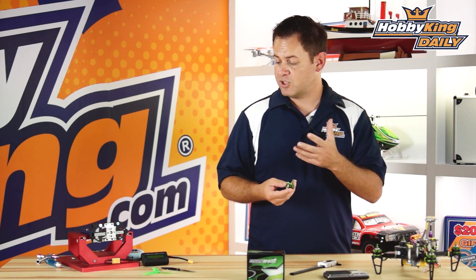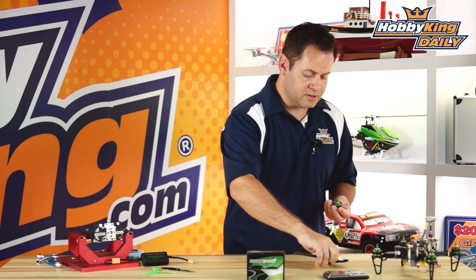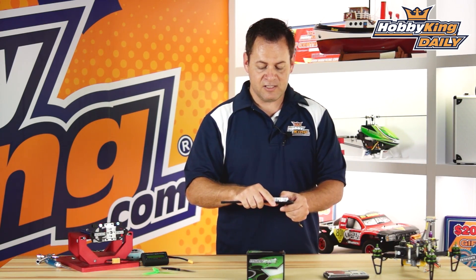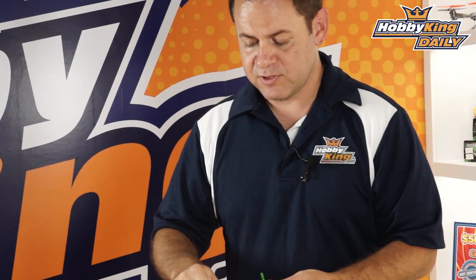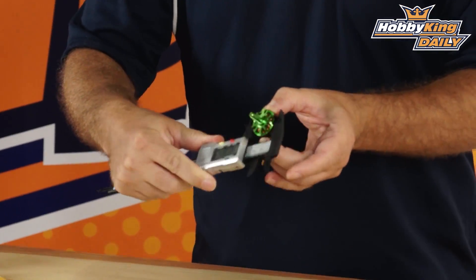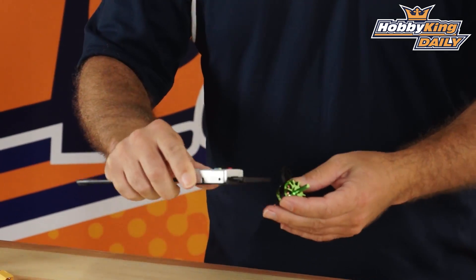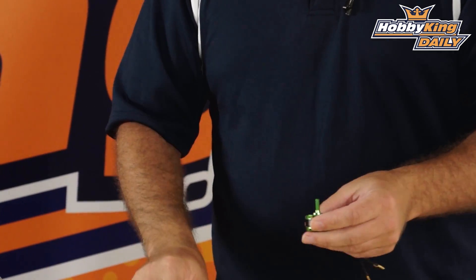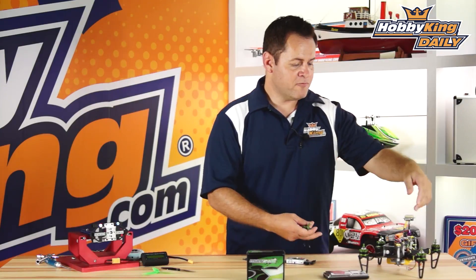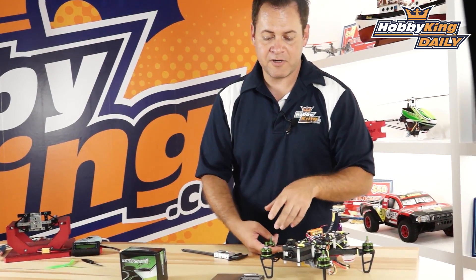Since it is a larger bell you have more torque, so you don't need quite as much KV. It's a very fine balance to determine what KV we wanted between all-out power and efficiency. It is 22 millimeters — meaning the electrical stator is 22mm — but if you actually measure the outside can, all 22s are actually 27mm. The overall height is a 2206, which is an indicator of the bell, and the overall height comes in right at 17 millimeters.